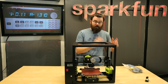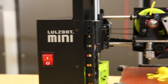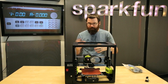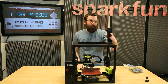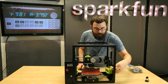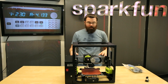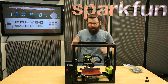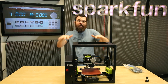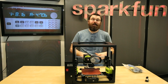However, it has a lot of cool features that the TAZ-4 and a lot of other printers on the market don't have. For instance, it has this nice aluminum frame and it's a lot more compact — easier to fit on a desk. It has this little arm that comes up for your spool holder and retracts when not in use. It also has this really cool bed leveling technique: it has these little metal plates at the side and it can actually level the bed, because no bed on a 3D printer is perfectly level. The software can compensate for that so you get a nice print out of it.